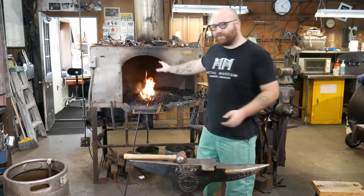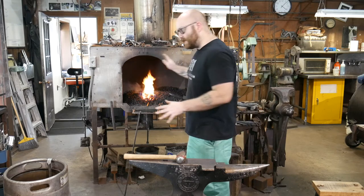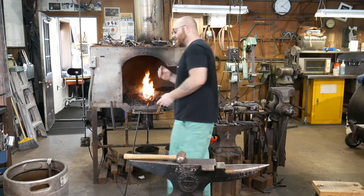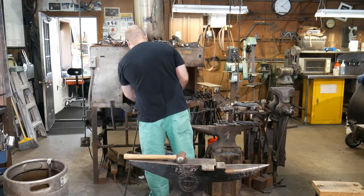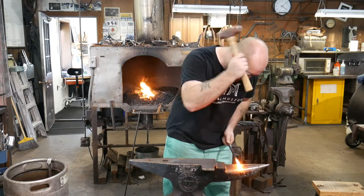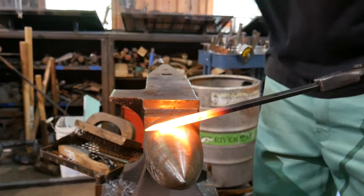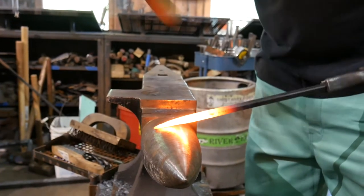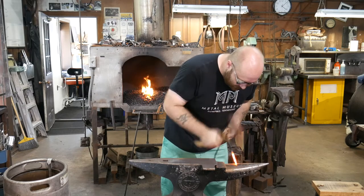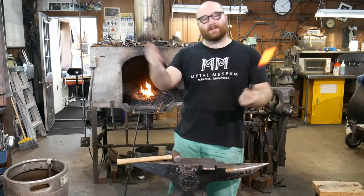The middle of my fire, when it's burning properly, burns at about 2,700 to 3,000 degrees, give or take — but only when it's burning really fully. The steel will actually start to burn in the fire, so you have to be very careful with how long you leave the piece in the fire. You'll pull it out and there'll just be a big firecracker on the end of it, and you won't have anything you can actually work with because it'll all be gone.